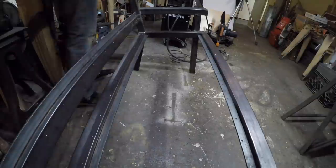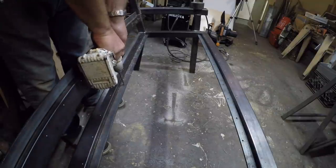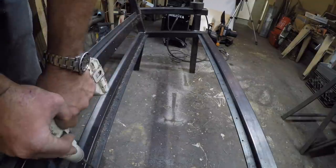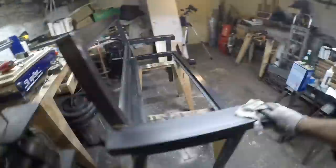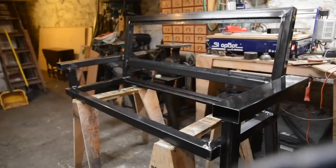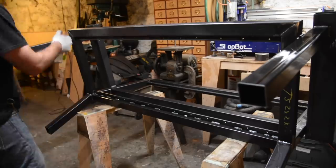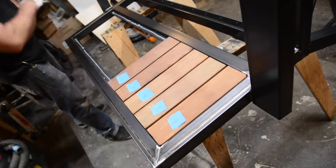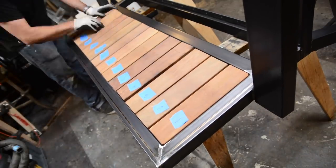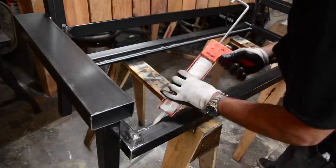You see the little white dots indicating where I needed to drill in the framework, so I'm laying out all the drill holes that will receive screws later. Now I wipe the whole project down with degreaser and a little acetone, and I'm using Permalac — a spray can lacquer that will slow the rusting process. It won't eliminate it; a bench outside is definitely going to need maintenance. I'm gluing the boards in with silicone and letting them dry before I come back and put screws in from behind.